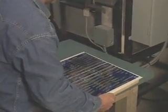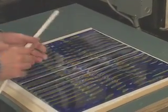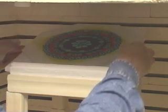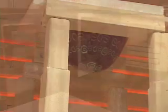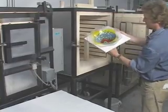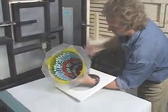The flat piece of glass can be left as is, or it can then proceed to a slumping process. In slumping, a flat piece of glass is placed onto a mould or into a mould and gradually heated so that gravity lowers the glass onto or into the mould. In this case, the mould is a ring and the glass will drop through the hole in the ring downward as it softens. As the glass stretches, the decorative pattern is stretched and distorted correspondingly.